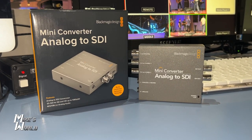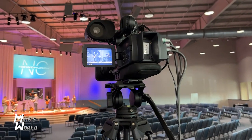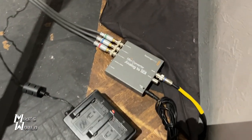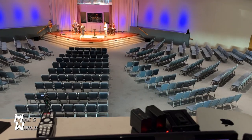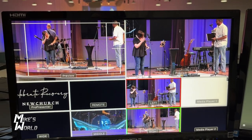This is actually what I use at my church — I'm the media director. We have two older JVC cameras that don't have HDMI output. They do have the RGB component output, so we use these converters to convert the signal to digital, and then that signal runs upstairs to our ATEM TV Studio HD switcher.